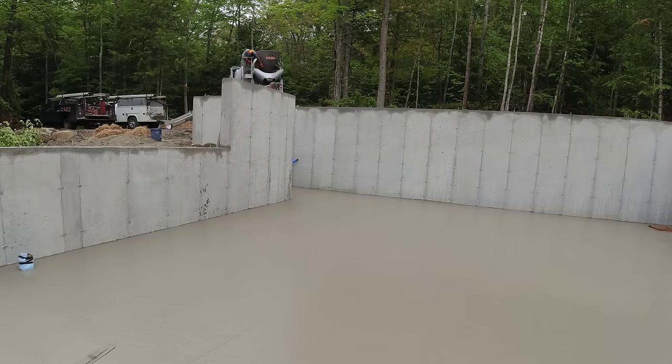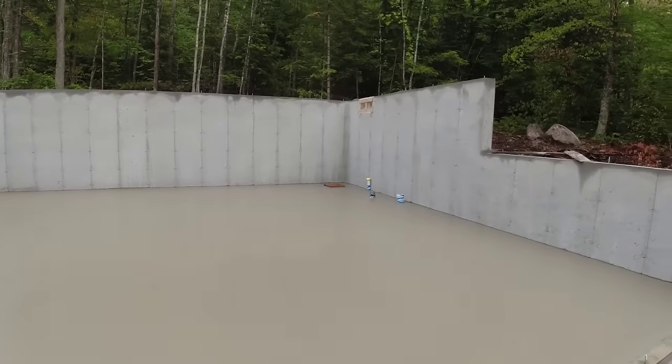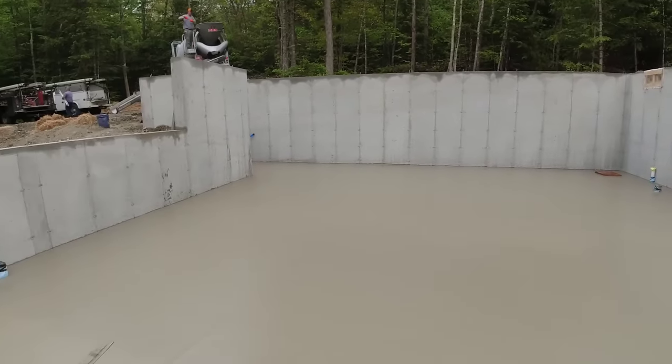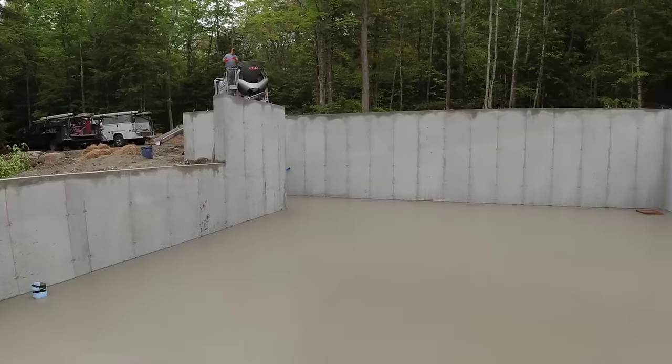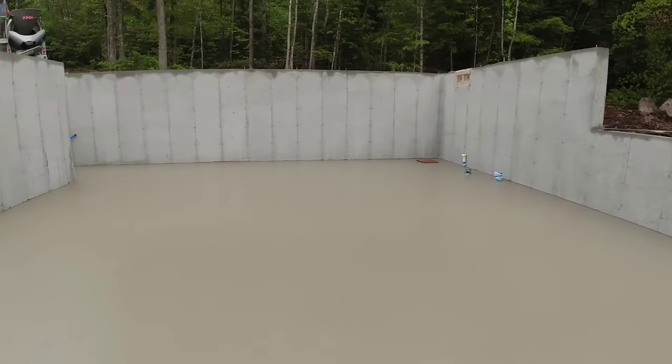All right guys, so that's how two guys pour a walkout basement floor, 10 and a half yards, 4 inches thick, fiber mesh, water reducer. I don't know what that took us, 30, 40 minutes maybe to do that, but it wasn't too bad, two guys. Thanks for watching. We'll see you on the next one.